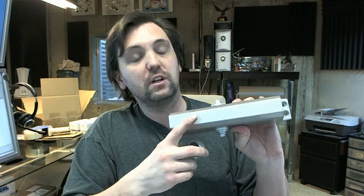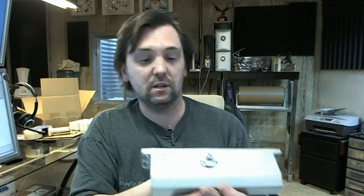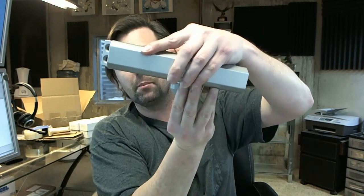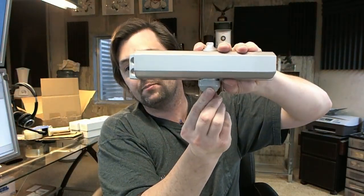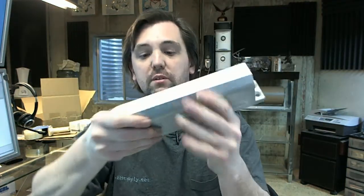As an option you can also order a cover for this. You can also order drop plates if you had need for that sort of application where you were doing an exterior door with this mounted to a drop plate, or if you had an aluminum door with lots of glass you'd definitely need a drop plate for that. A plastic cap is included to finish off the one end, which would be the bottom side, and generally if this is a parallel arm mount, regular arm mount, or top jam, this would go on the top — opposite side of where the closer is mounted.